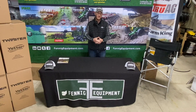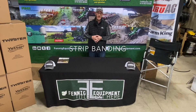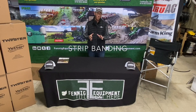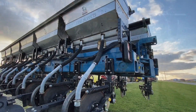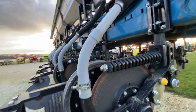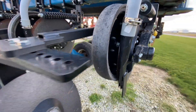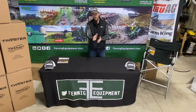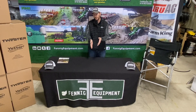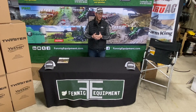Now I'm going to talk to you about another face of strip tillage that's not really tillage at all. It's just strip banding, or fertilizer banding as we call it. That is where you pair a low disturbance opener like the Yetter Magnum, the Yetter Nutrient Pro 4000, or several other coulters with fertilizer placement. So we're basically going in there and putting fertilizer three to six inches deep, either in the fall or the spring, in an extremely low disturbance manner — just slicing open the ground and injecting dry or liquid fertilizer in there. The whole goal is to maximize the uptake of it. This type of strip tillage or fertilizer banding is becoming extremely popular as well.